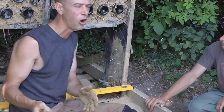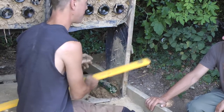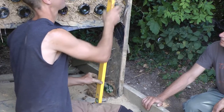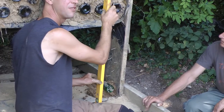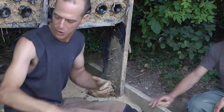If you're doing a garden wall, you have to be checking plumb as you go as well by using a level, much in the way we were checking the tires to make sure that we had that 1-inch batter, where you hold the level up like this and you look at the bubble and make sure it's between the two. So if you're outdoors, you do a plumb line a different way than indoors with the stud work, okay? So that's the first thing I do, the first check.